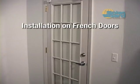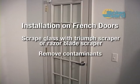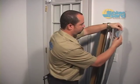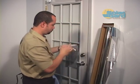Cleaning and preparation for French panes is similar to that of larger panes of glass. Scrape the glass clean using cleaning solution and a 3-inch Triumph scraper or razor blade scraper. Pay particular attention around the frames to ensure that any excess paint, putty, built-up dust, or other contaminants are removed from around the frame. Continue to clean the glass using a scrub pad and/or lint-free cloth or paper towel to remove any leftover residue around the perimeter of the frame. Be careful to handle the film as little as possible to avoid contamination of the adhesive.